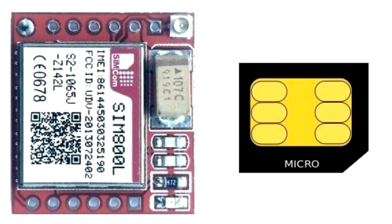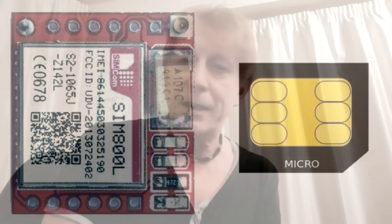I'm going to keep a spare SIM in here — actually you can put a different SIM in, so I'll keep one for the EE network just in case O2 is not available wherever I am. If you mount it permanently in your van, you'll want to put it in a spot where you get a signal — but if there's any doubt, the company also sells remote antennas that you can permanently fix on your roof and run a cable down. Now when you put the SIM in, get it the right way around — the clipped-off corner goes on the right-hand side as you're looking down on it.